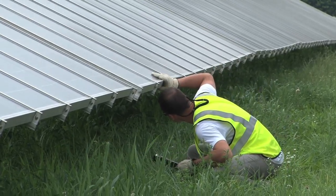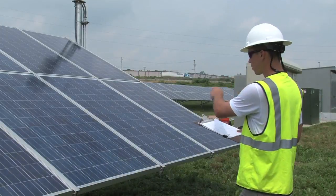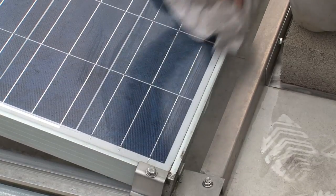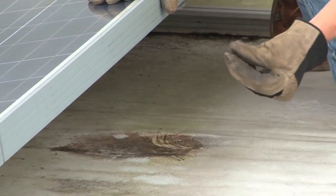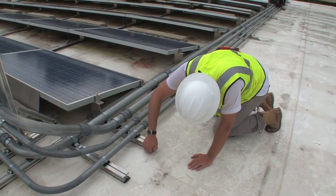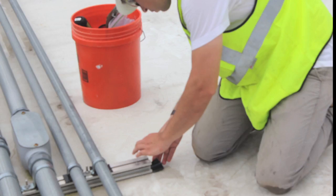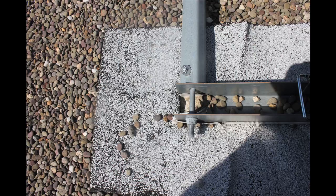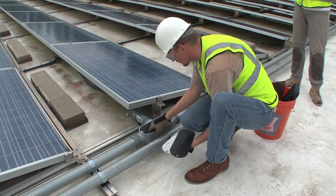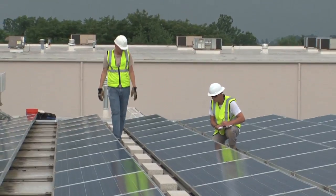For a ground-mounted system, they are looking for erosion and vegetation growth as well as any corrosion or damage to the mounting system. On a roof-mounted system, they are looking for algae, water damming, dirt collection, or vegetation growth on the surface of the roof. The crew will also look for any space where the racking system might be harming the integrity of the roof. For a ballasted racking system, this might be a slip sheet or a pad under the ballast, or pads sinking into the roof. On an attached system, cracks and rubber boots should be noted as well. The crew will also check junction boxes, take the covers off, look at the connections inside, and look for water buildup and varmints. Later, tests may send a crew back to revisit any of these areas.